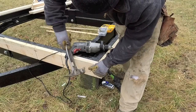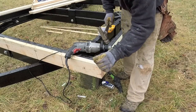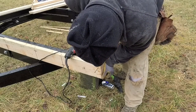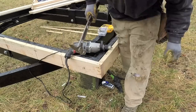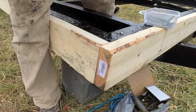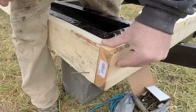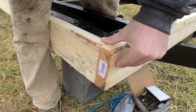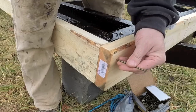Now because I'm going real close to the end of the board, if I take the end of the nail and I just dull it over like that so it's blunt, it won't split the wood. I'll make sure I'm flush. You can see here I've got a board that's twisted — I'm going to fix that with a toenail. A toenail is just an angled nail. I'm going to bring it flush, then nail up my end.